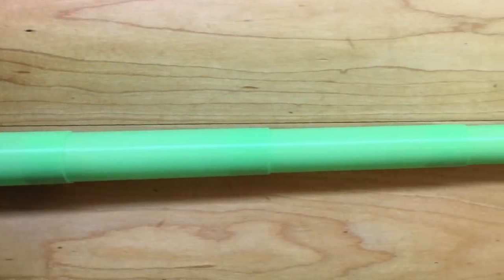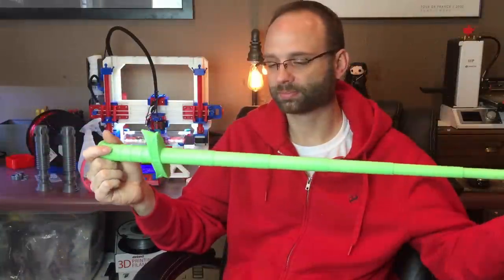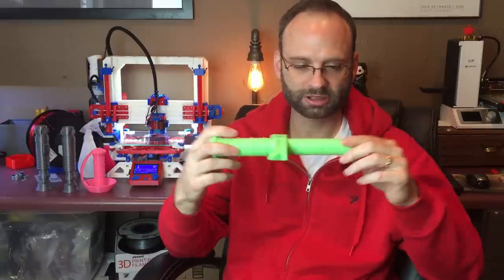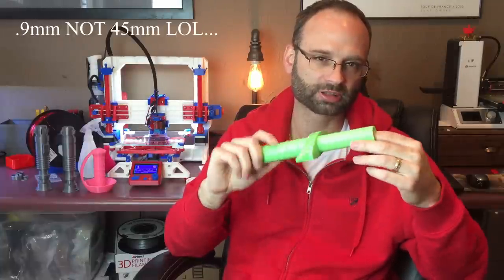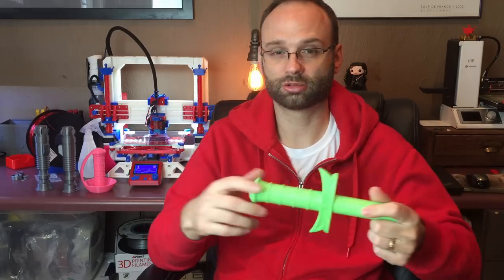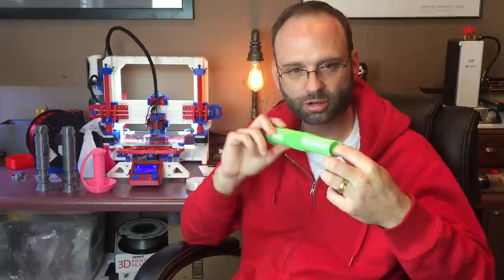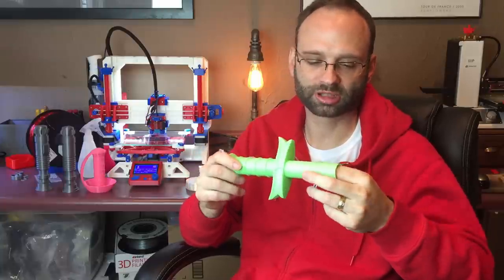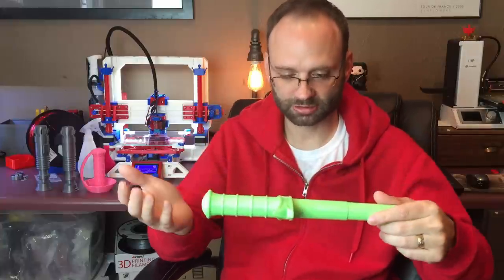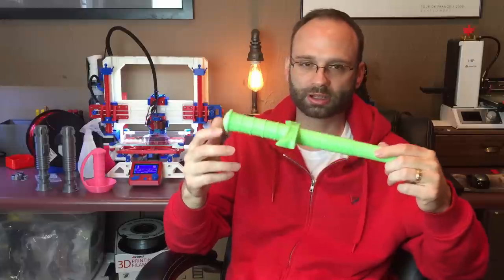This isn't actually the first sword I made — I made another version but it got destroyed when someone had a little too much fun at MRF. It actually took me three prints to get there, because the blades are only 0.45mm thick and designed to be two shells when printed. The problem was I didn't have coast-and-wipe turned on. Since there are only two shells, when you retract there's nowhere for the plastic to go, so if it forms any blob the segments fuse together. That's what happened to my first two prints. I was about to give up, but tried coast-and-wipe and it fixed the issue.